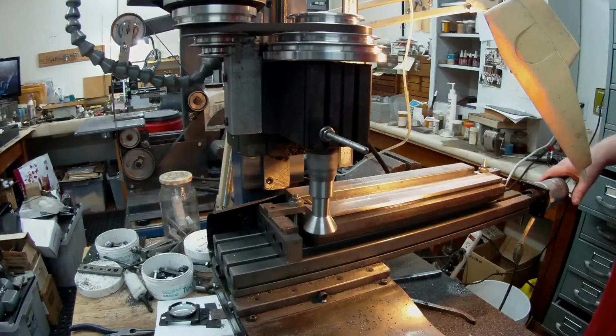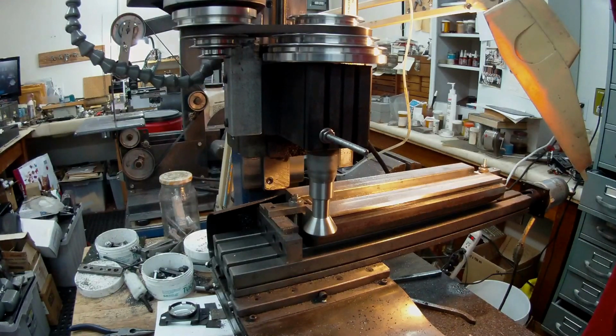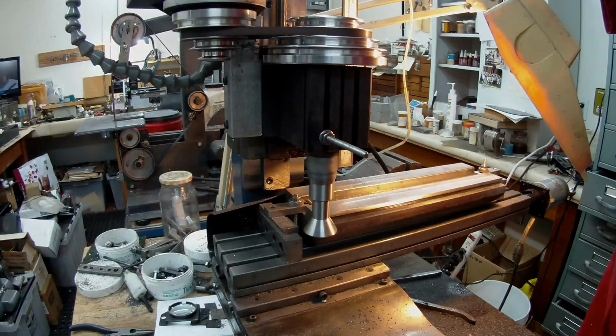Continuous all the way along. Okay, so I think I can wind it down to 0. I wound it up about 100 thou before I made contact, so I should touch on here at 0, but I'm not going to go right down to 0. It's a big cut to take on a dovetail cutter on that blade, so I'll bring it down to 4.